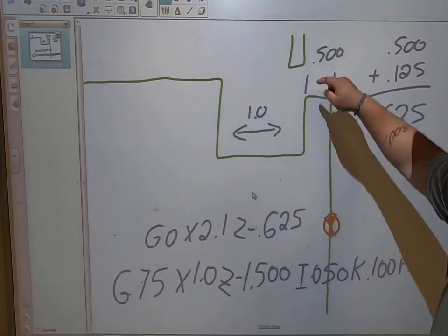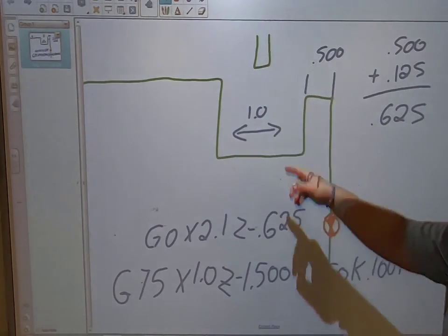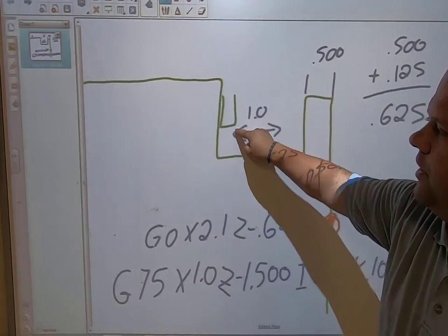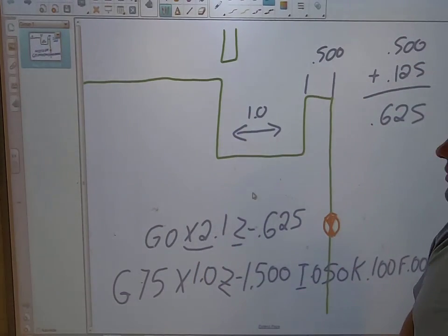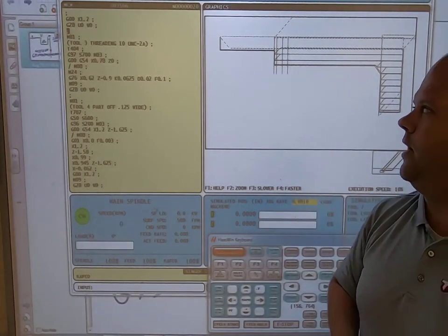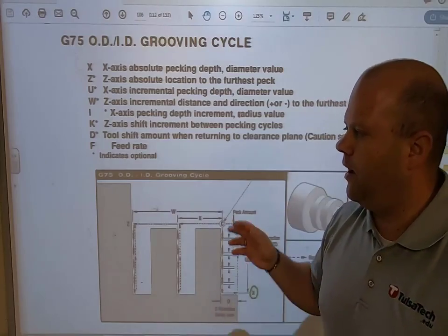If I do that, the tool will come down, come up, come over, come up, come over — it's going to keep doing it. With this being an inch wide, and moving over a hundred thousandths each time, it's going to come over ten times — one, two, all the way up to ten. On that last pass it'll come down, come back up, and stop at X two inches, one hundred thousandths. Keep in mind, whenever you're running your parts, watch it in simulation — make sure they are feed lines, because dotted lines are rapid moves. All this information is in your books. If you have any questions, come holler at me. Again, I'm Aaron Runk — thank you for watching.